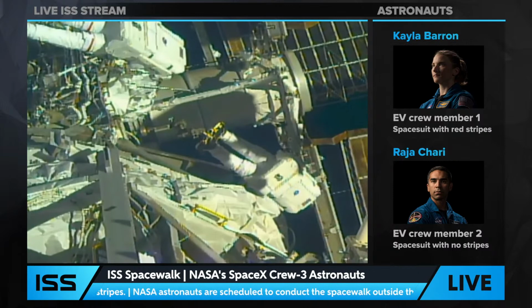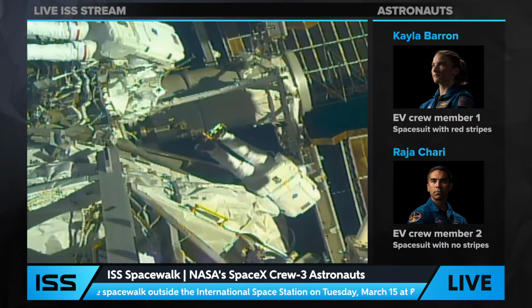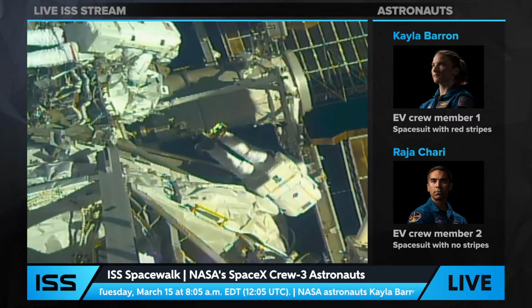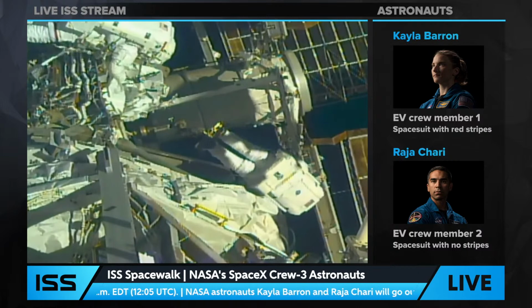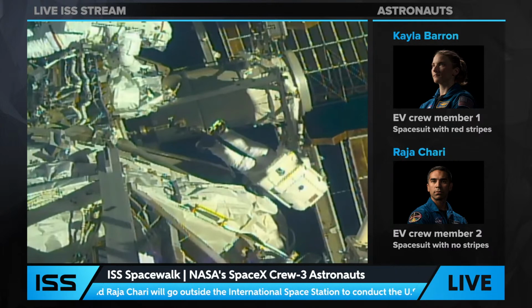Baseline, I'm trying to remember if I saw this before, but there is a little bit of RTV wear below my right index finger. Copy, was that a spot that's come up? Did you say below your index finger or on the right index finger? Just below it in the transition between like the pad RTV and the turtle skin RTV below it. Okay, right index finger, and we've got a good video of that as well. Thank you. We copy. Right index finger, RTV wear.